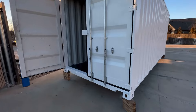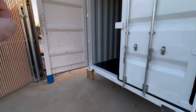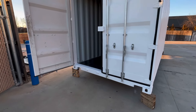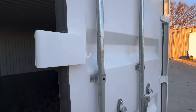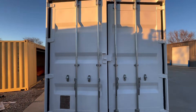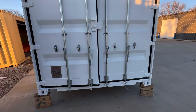The critical thing to do when you paint a container is mask your seals and your handles off. I absolutely hate it when people paint the handles and the seals — it looks like complete trash. You can see here we masked everything off, and honestly you can't even really tell we painted this thing minus the decals being missing. You've got to paint in the jams and all your hinges. After you spray the outside, you've got to come in and roll some of the door jams and hinges and things like that.